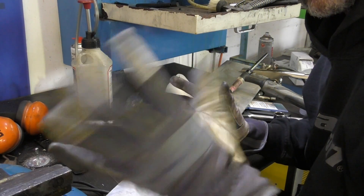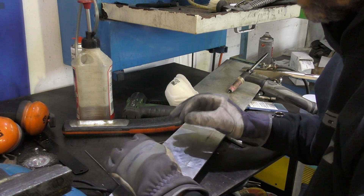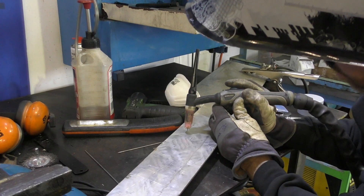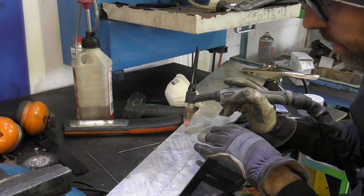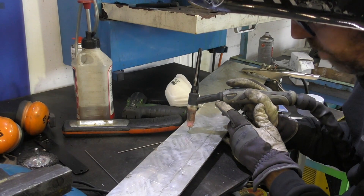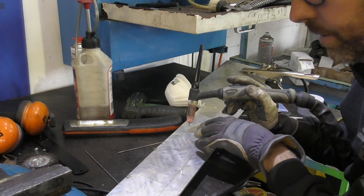I've put some leather gloves on because the work gets very hot, and although TIG welding doesn't give off a lot of splatter the way stick welding does, it does give off a lot of UV. So if you don't have long sleeves on, you can get really badly sunburned. I'm going to start by just hitting the button — all that happens is the current starts flowing. I don't have a foot switch, so all I have is essentially an on-off mode. What I'll do first is hold it a bit above the aluminium and see how much the tip balls up.